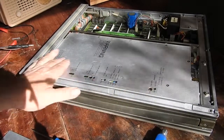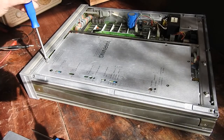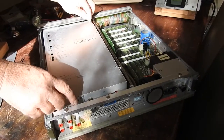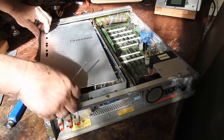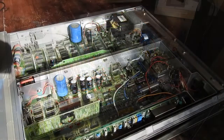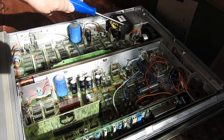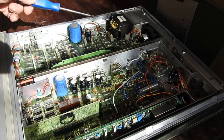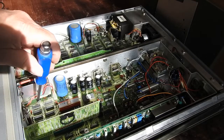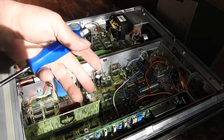This first plate just covers the adjustments so that you can't fool with them inadvertently, though I don't know how you would do that with the outside cover on anyway. The meter has a pretty usual configuration for these sorts of things. There's a shielded analogue section inside a box and a digital section out here with power supplies which are isolated between the two sections. Each one has its own individual secondary coming off the transformer, and the two communicate via this cable which goes down to a couple of opto-isolators and a pulse transformer.